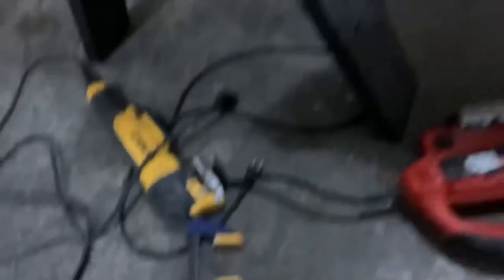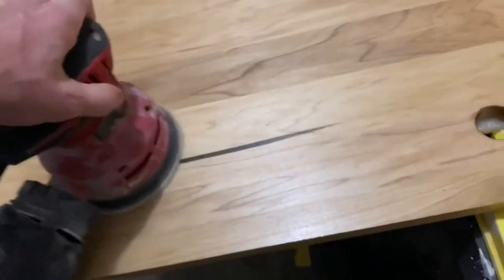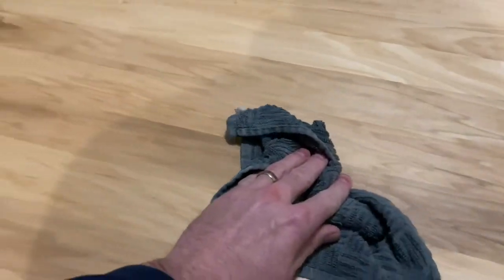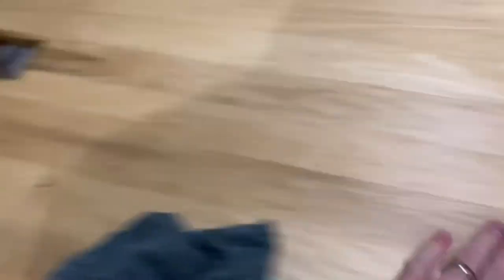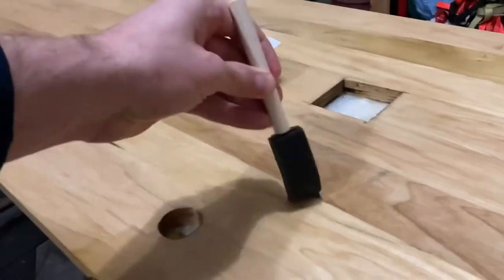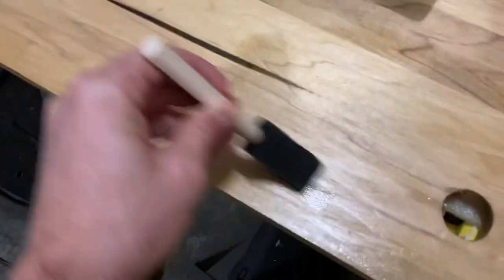In my testing I figured out that sanding between coats is better than not sanding — both for aesthetics and to knock down bumps. If you move the brush along an unsanded part it kind of snags a little bit. I preferred sanding lightly and then wiping it down, because you don't want to apply fresh stain on top of dust.